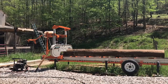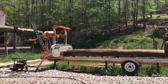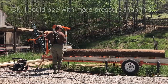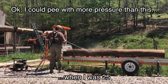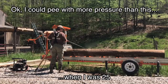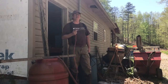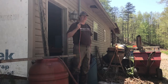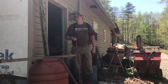All right, so this log obviously has a bit of a dirty belly since we dragged it through the woods and the road and the mud. So we'll see if I can get a siphon here and start washing. Well, that sucks, or does it? So, couldn't get enough siphon there, got a little burst of pressure, so obviously not elevated enough. That's why I wanted to do the IBC tote elevated. Can't get enough head pressure there that it could feed the pressure sprayer.